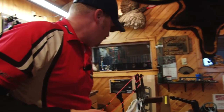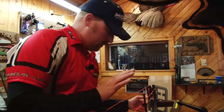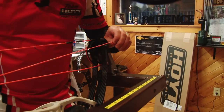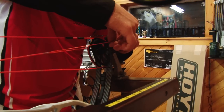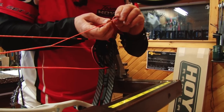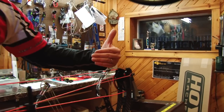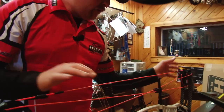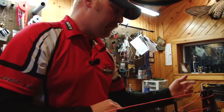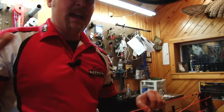When you say tighten the right yoke, you're not going to go 60 twists. No. So now we've got just a little bit of pressure on the press. I'm going to pop that yoke off — a little can go a long ways. I put two full twists in it, that's all that I did, just to see if I could get it a little straighter and help my optimum rotation for tune and for forgiveness. On a cam and a half system, I like that top cam to swing around and hit the draw stop peg just about an eighth before the bottom.